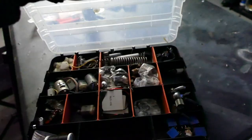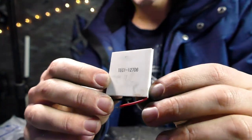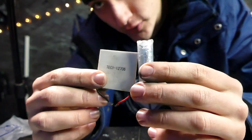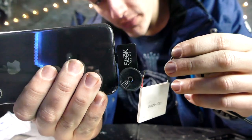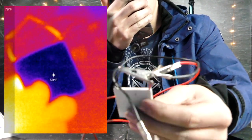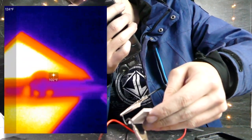So this is a pretty cool trick, and there's one other thing I want to do to make this a real spy device. I've got a Peltier module — I'll put the word on screen. Pretty much, it's a module that when you pass current through these two wires it gets hot on one side and cold on the other. If you apply a temperature difference between one side, you can actually generate a current. Because gallium is temperature sensitive, I want to try and create a necklace — wear it, have a little bit of gallium on one side, and when you pass a voltage through it the gallium will melt off. I've got a thermal camera attached to my phone so we can see the temperatures. It's super cold on one side, and flipping it around you can see it's getting hot — up to 117 degrees, which is more than enough to melt gallium.